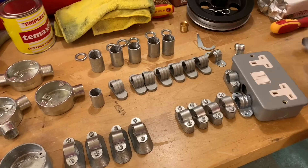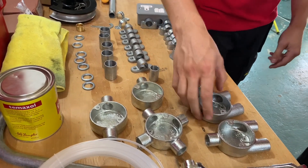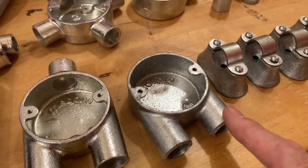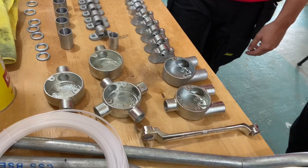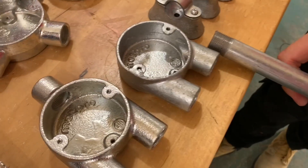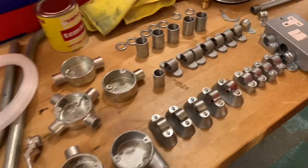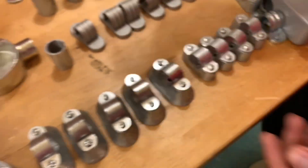So that's the saddles and the crampit dealt with. Moving on to some traditional boxes — starting with a U-box. It has a couple of threaded spouts so you can thread the conduit straight into the box itself. The holes are pre-tapped for M4 screws, which are used to hold things like box lids on.